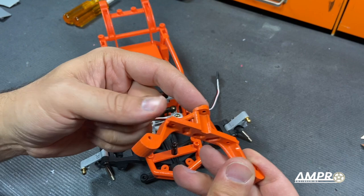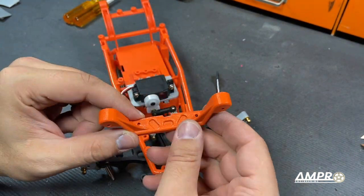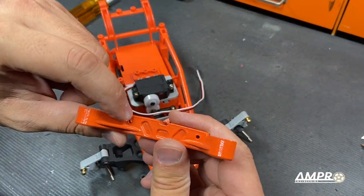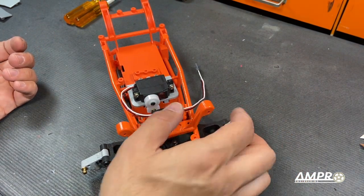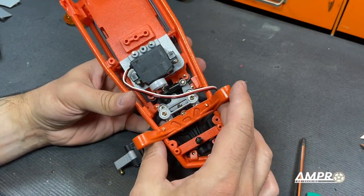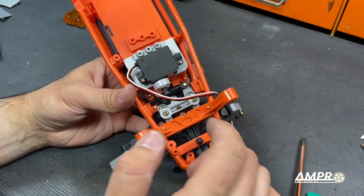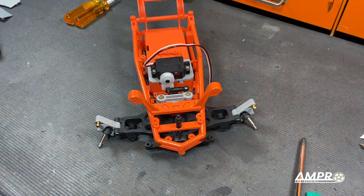For this one here, you'll need an 8mm long self-tapping screw, and for these, you're going to come up from the bottom from here and tap into these with, I think, a 12mm will be fine. Part of me feels that a machine screw would be best suited up here, but this is all that new HP Fusion printer, so I want to test that out. So in the meantime, we're going to use a self-tapping screw. We can at least install some shock absorbers now.